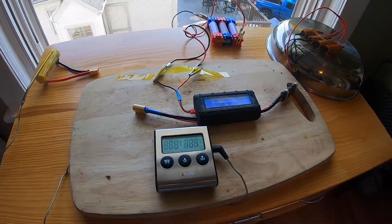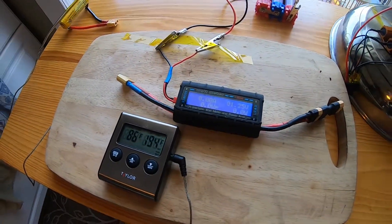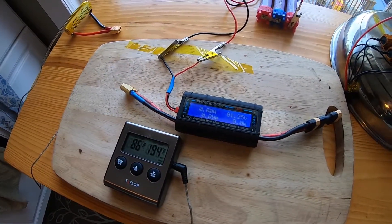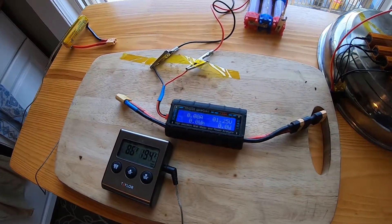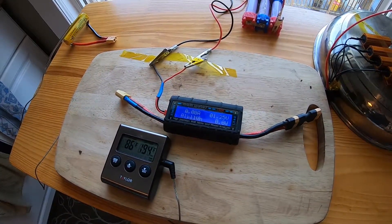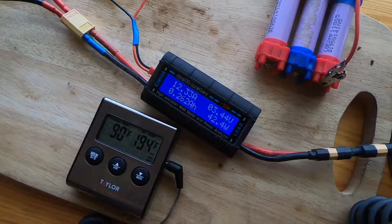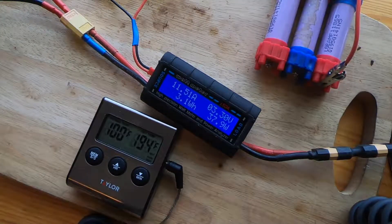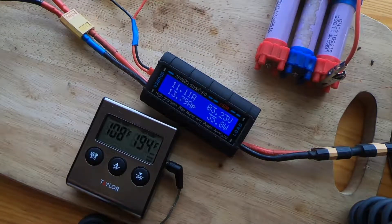We're gonna set the camera up on autopilot, plug this bad boy in, and see what kind of amps it puts out — whether it'll hit 15 amps. I'm gonna try to drain it down to about 2.8 volts, which is actually a lot lower than I typically would. Right around 3 volts is probably where I'd have my standard cutoff. Then we'll charge it back up and see how much capacity goes back in after a charge. I actually did two tests — I'm gonna speed this up and spit out the relevant numbers from the watt meter.